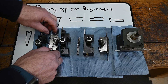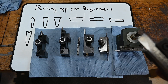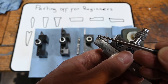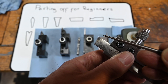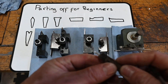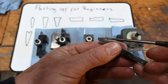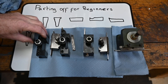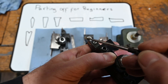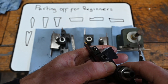Just to try and show you a little bit more of the closer-up geometry of the cuts when you're grinding. We've got this little cut-out there, and what that does is cause the chips to curl out and break off, which is what you want - but we'll look at that in a little while. This is another version of it. The cross section of my favourite parting off tool is straight, but in this part of the tool there are little indents which cause the chip to curl and break off.